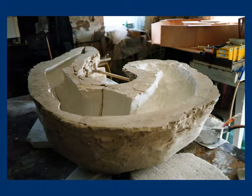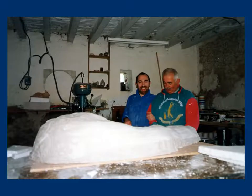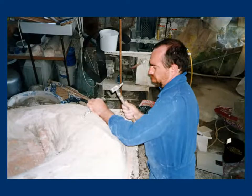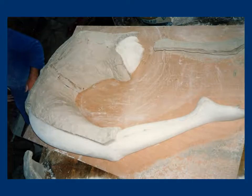The shell is shattered and the mold broken. The sculpture of mixed wax is bolted with the battens on a base made of wood, which in turn will become the bottom part of a formwork. This stage is necessary in order to avoid any movement while pouring the fireproof plaster.